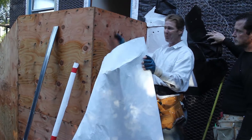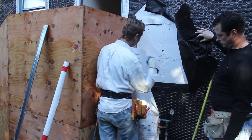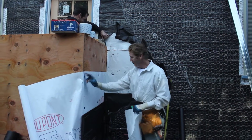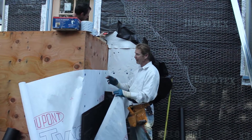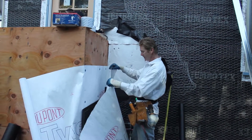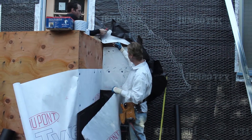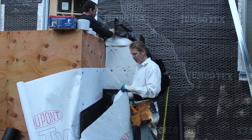It's always good to put a porch on beforehand, but sometimes we don't have that luxury. I like to get pieces that are solid; otherwise I've got to use this Tyvek tape. There's a flashing system for windows and stuff, but that's not what this video is about. What it is about is the difficulty of tying in. So we've got the piece here and we've got to tape all the joints with this stuff.